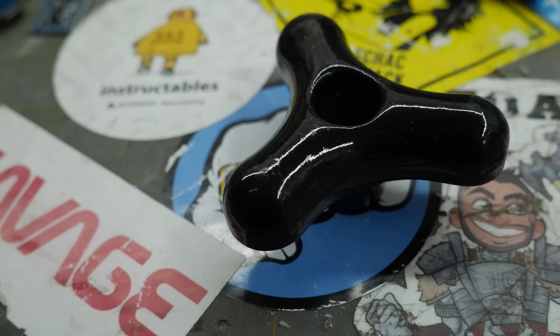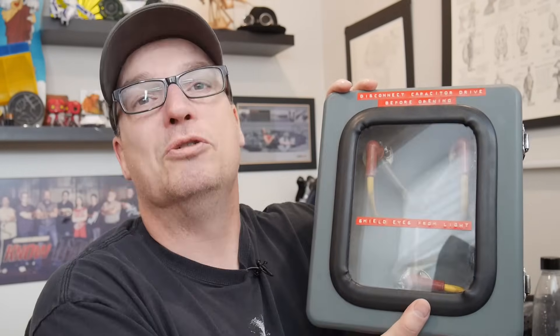I've been making flux capacitors. This box is all 3D printed because they're cheaper to print than to purchase online — I just wanted a replica. When I did the edges of one of these boxes the first time, it took me about four and a half to five hours to sand it down and get it ready for paint so it would look good. The next one, I got the card scrapers — 30 minutes. My jaw just dropped. Now I don't know about you, but for me this is a huge game changer for 3D printing, at least for FDM printers. Sometimes you don't want to use FDM because they leave layer lines, so you go to a resin printer, but resin is stinky and doesn't necessarily have the same structural qualities. And by the way, these things do work on resin printers as well.